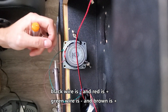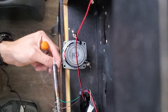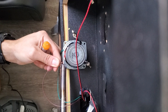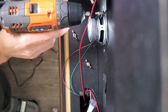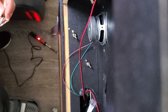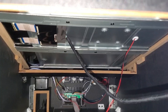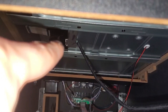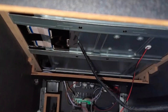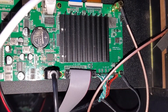If you have to add solder, you could do it just like this. I should really be holding it steady for about ten seconds. Now you do have another connection going to the monitor. If you don't have a signal going to the monitor, then you want to check that connection. Right here is the monitor connection — you can reseat that and see if that fixes your issue.